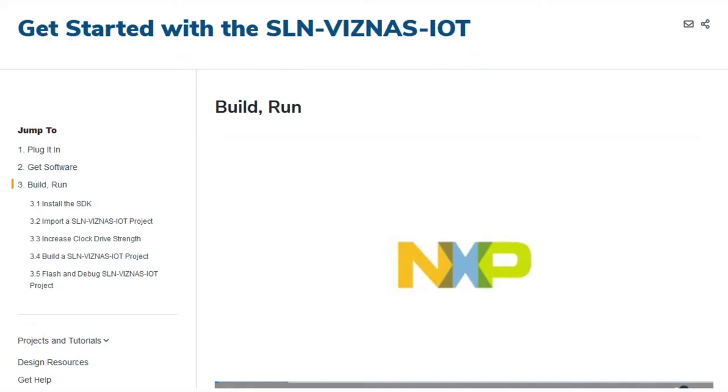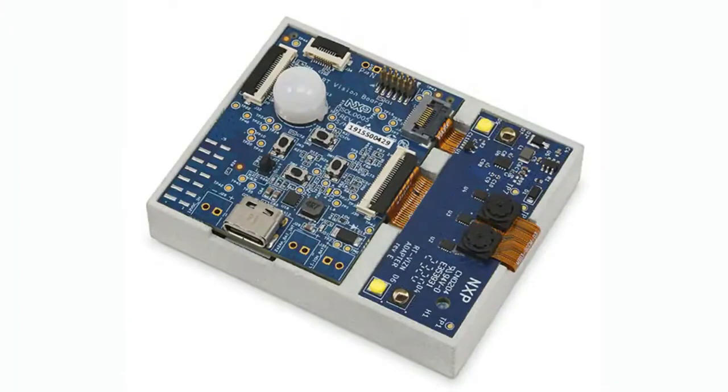They've got a nice web page that I checked out — it's got all the details and was super quick to get started. This board is the SLN VizNAS IoT dev board and it's ready to go — it has everything you need to do your project or product. You can also buy the individual chip, which is about $7 and comes with the license and software. It's a BGA chip and NXP will help you get it integrated into your product. But I would get the dev kit because you could probably just use it as is — it's a great edge facial detection system. They have the code; you just need a J-Link programmer and you program it up with NXP MCUXpresso. The source code for the demo is open source so you can hack and mod it, and there's a TFT screen as well.